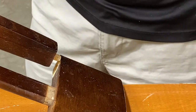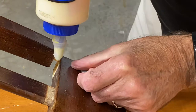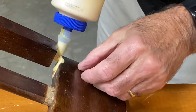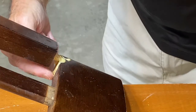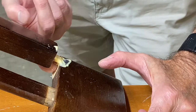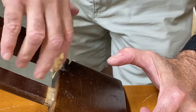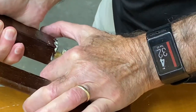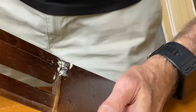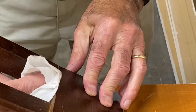We were fortunate that we had enough play in our wood that I could move it around, pull the top up, and slide that peg back into place. I want to make sure I get plenty of glue on there — plenty on the peg, and also on the top and the bottom. In this case I'd rather have excess glue. If there's too much and I've got some squeeze-out to deal with, I'll take care of that after the fact. Once I've applied plenty of glue, I can pop those pieces together and bring them flush with each other.